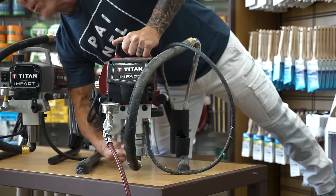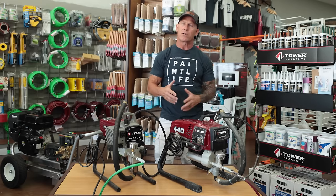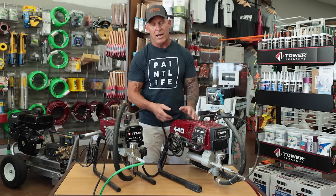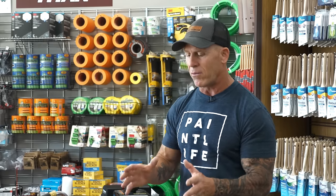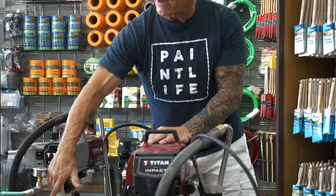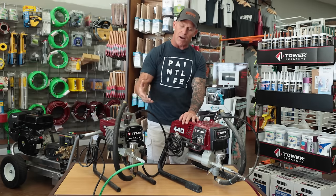This has a push ball valve right here and that's a really great thing they've added to this sprayer. When these sprayers have sat for a long period of time — sometimes even a short period — the lower ball will corrode and stick, and then the sprayer won't prime. It will also sometimes get debris caught in there so the ball won't seat properly. In the old days, before we had a push ball pusher, we would just take a hammer and hit the face of the lower end to release that ball. But of course, you're going to have employees banging on it extremely hard.